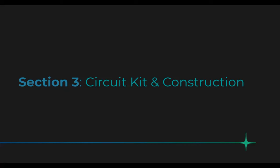Okay, there you go. All right, and then resistance, or ohms, right? One thing to note before we start about the current: if you look on the right side, which is the A with the line, you see 2000 micro, 200 milli, and 10. With the middle one, you can only go up to 200 milliamps. You always want to start with the highest value for current because you don't know how much current you're going to get, so it needs to be safe. Don't just try something on the multimeter. Start off with the highest current setting and see what happens.